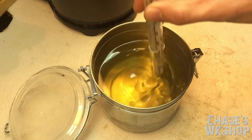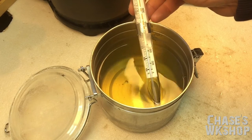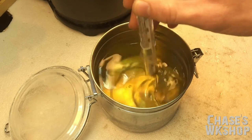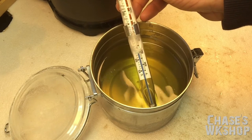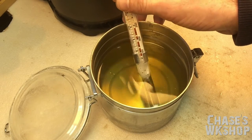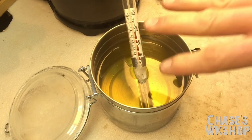We're at about 143 now. I stirred it and it shot up to almost 150 — you can see stirring this stuff reveals hot spots in the wax. That's something you have to be careful of. Now it's jumped back up to almost 150, so we're going to let it sit. Always remember when you're doing this: once it gets to a certain temperature, stir it around — it'll mix the hot spots together and give you a more consistent temperature through the whole mix.